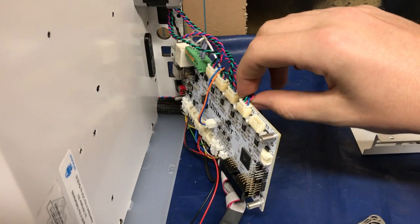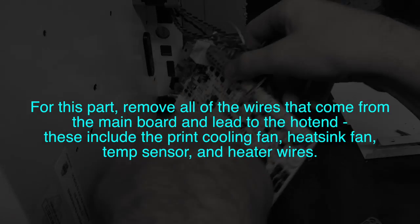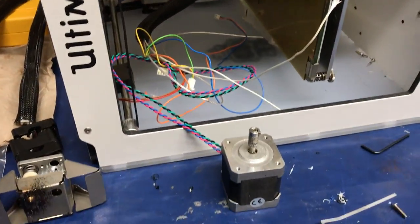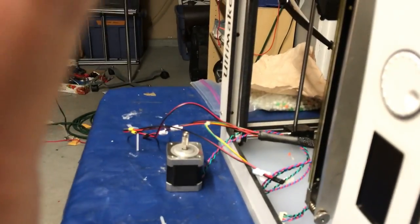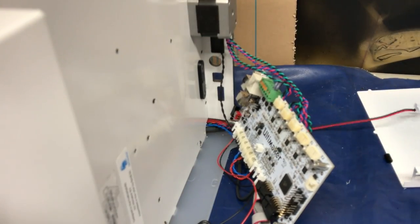So the first thing we're going to do is take out E1 — E1 is the extruder motor. We've got all the wires out here and now I've got the stepper motor free. Now what we'll be doing is pulling out the old wire harness from the back right over there and putting in the new one. We have our new wire harness and we're just going to be running those wires right through the hole down in the corner here.